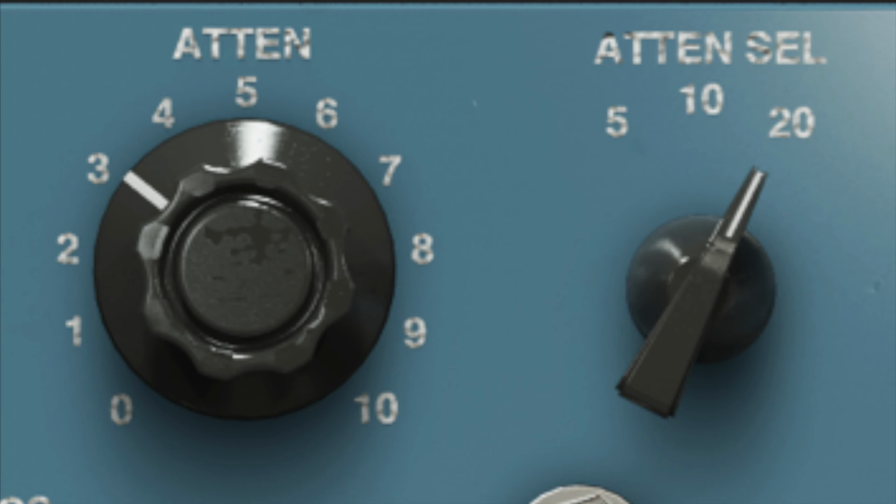The original hardware unit had instructions to use either boost or attenuation on both low and high frequencies, but many engineers found that doing both, boost and cut, resulted in great sound, and it was often used that way. The reason for this is the cut is not the exact opposite of boost, and some interesting curves result from doing both at the same time.